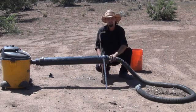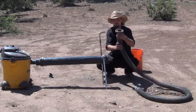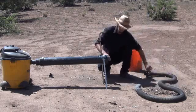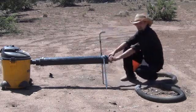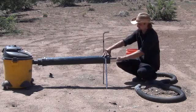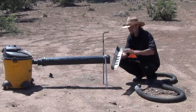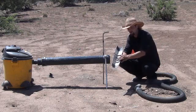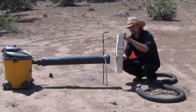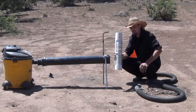First thing you're going to want to do is remove your dredge hose. You just twist the whole system here — pulls the whole end cap out of the 4-inch PVC. That's a threaded PVC 4-inch end cap hooked right to basically your dredge hose. The first part of the sluice box you pull out is your nugget check — that's this piece right here. It's got two purposes: it's got some riffles in it so it can catch any large gold, it's also got a perforated sheet. On the underside I cut out the PVC and allowed for some channels underneath — that's a fine gold catch and nugget trap underneath there.